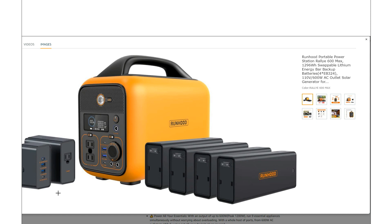Another thing that makes this extra special are these adapters. This one is actually an 80 watt pure sine wave inverter — typically you don't see pure sine wave on inverters less than 200 watts, so that's obviously going to be really nice. For a small load like a router or a small TV, a 20–40 watt load should be no problem. And with a really small inverter like that, you're not going to have a lot of overhead with the inverter itself.